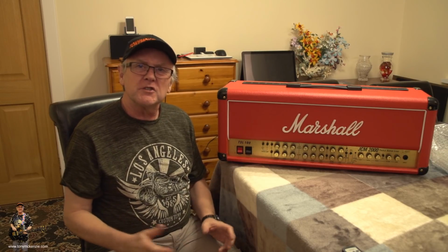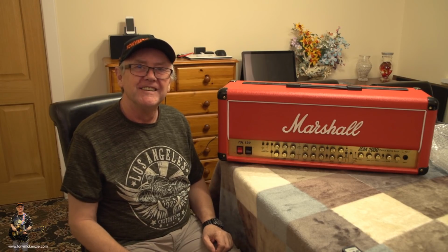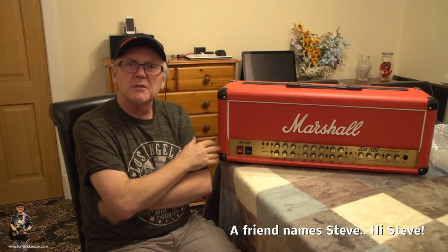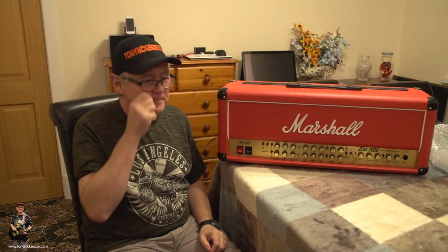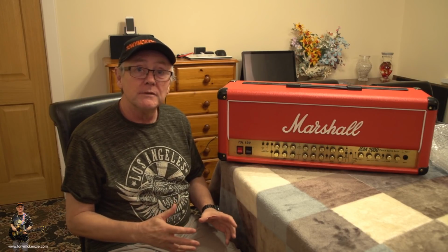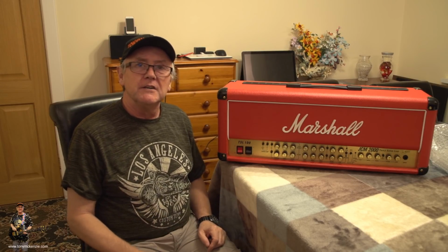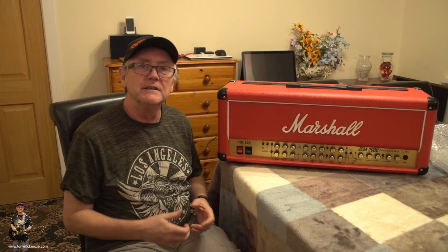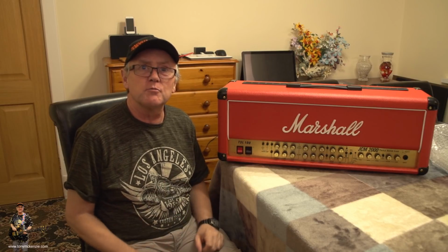So I got talking to someone about these, and he said, "Oh, you must have had the problems, right?" I said, "What problems?" He said, "Oh yeah, they're awful. They keep blowing up and the bias keeps going out and floating away and doing the tubes and stuff like that." So I did a little bit of investigating, and it turns out that the original amp, before revision 7 on the main PCB, either had wrong resistors or wrong capacitors, or the board was made of a material that as it got warmer soaked and allowed the bias to float away, which blew the tubes and all sorts of problems.